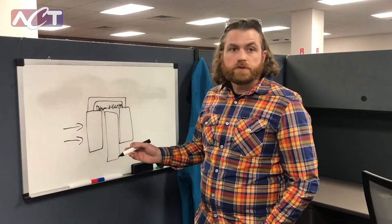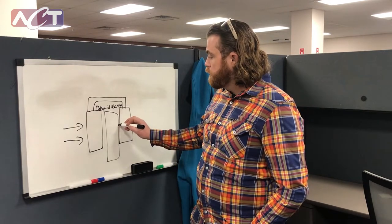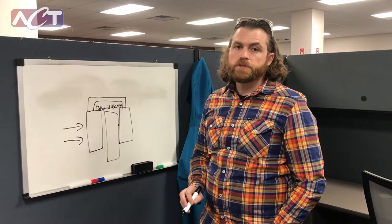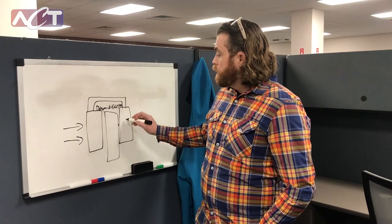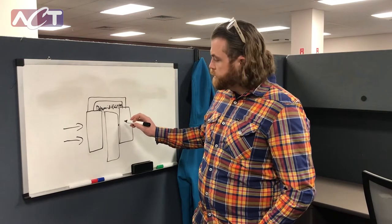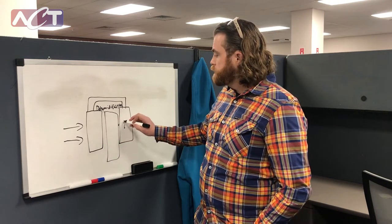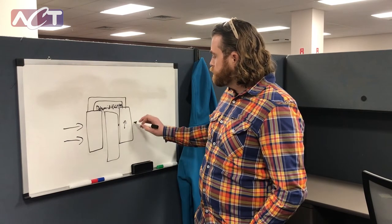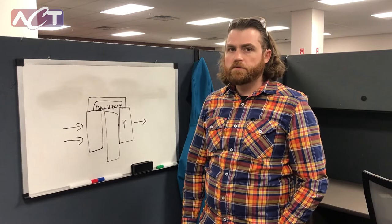With a lot of these systems too, there's additional reheat that needs to be added to get this temperature of the air after the cooling coil back up to the discharge temperature set by the building. Our second coil here takes the energy from pre-cooling the incoming air and reheats up to our discharge temperature that can be out into the space of the building.